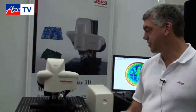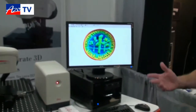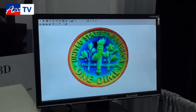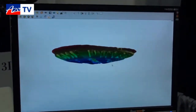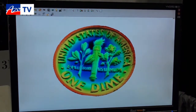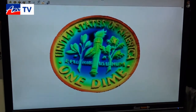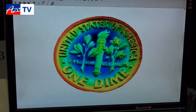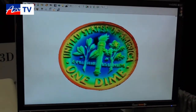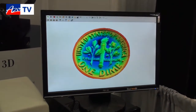Easy to work with and easy to use. You can see here is an image of a coin measured with a confocal microscope, and what we have is a full three-dimensional surface map of the coin. We can take this and make measurements of the roughness, step heights, and different features. This is an example of a large feature. We can also measure things in the sub-micron range, like photoresist on semiconductors, step heights of microelectronic material systems, etc.